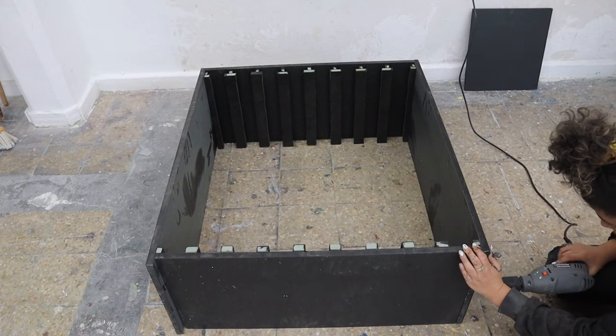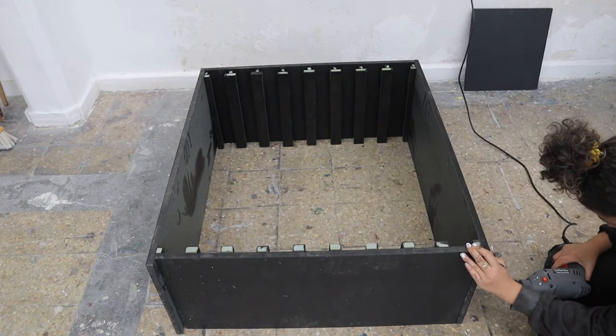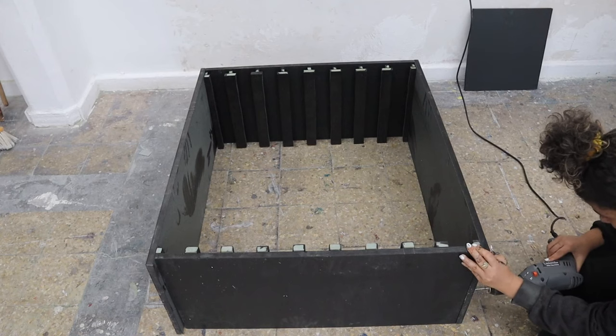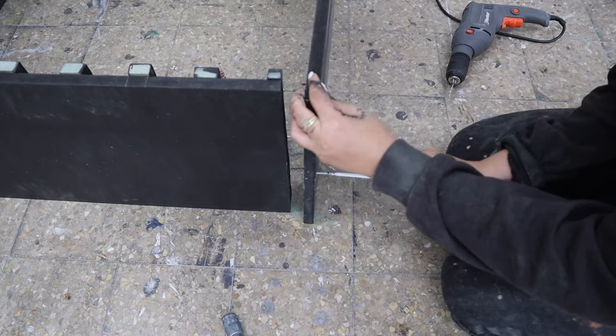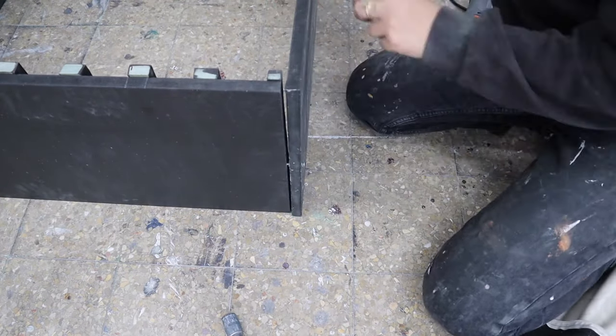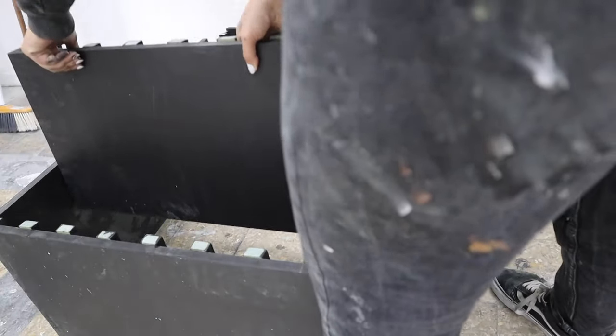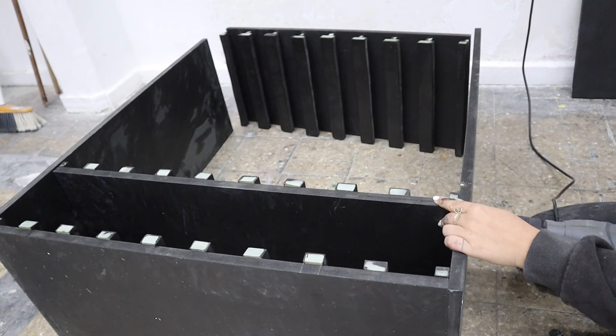I created and drew this cabinet so that the top and the bottom of the box would be internal compared to the vertical lines. So as you can see, the bottom, that is the one that is holding the wine bottles, is also laying inside the 2 external lines, and that's why, even though we drew it of only 76 centimeters, at the end it's gonna be an 80 centimeter cabinet.